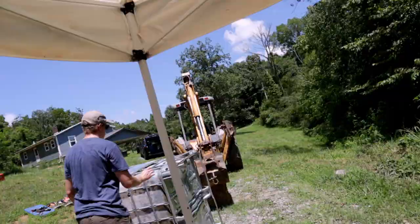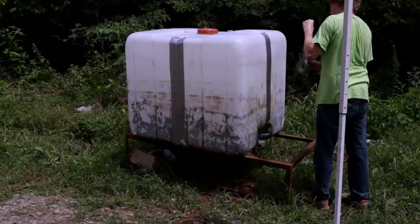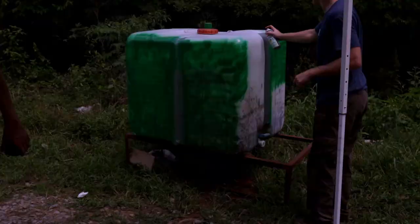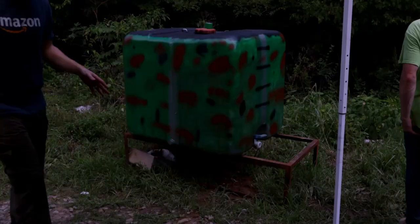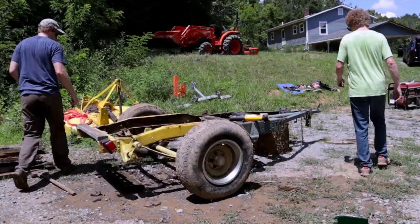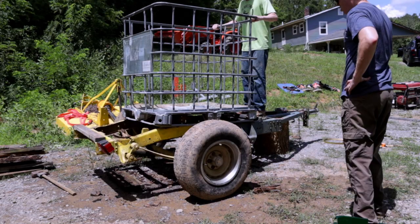During the summer, sunlight gets into the tank and algae grows, which ends up clogging our discharge system and the hose. By reducing the amount of sunlight getting into the tank, that algae will grow less fast and we should have less buildup over time. We painted the top black to absorb as much sunlight as possible, but went with a fun camo pattern on the sides. We also put three strips of duct tape vertically on all four sides, so once it is dry, we can peel those and have a water level marker on the side of the tank.